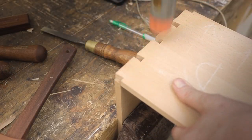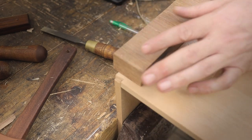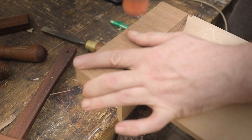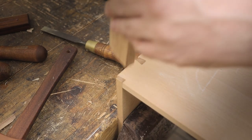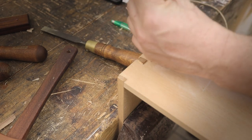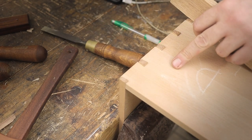With the pin board done, it's basically time to test the piece and see if it will fit nicely. I'm speeding up the video here because I'm taking it slowly, also using a block to distribute the weight just in case I start fracturing or splitting some of the wood. Because of the protruding dovetails, I have to use a pin to whack each tail individually into the pin board.